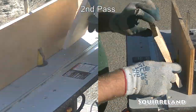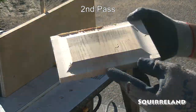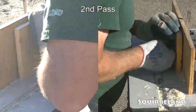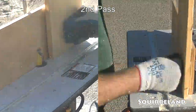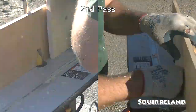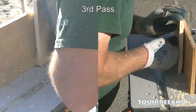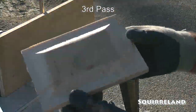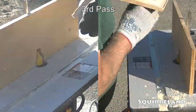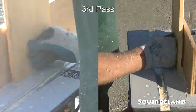This means that after I ran all four sides of all six boards through the router table, I would move the backboard back about an eighth of an inch and do it all again. I also ended up making a modification for the backstop of my router table — I added a piece of plywood with a hole in it that is very close to the size of the router bit. I did this because some of the pieces I'm making are too small to make it across the large opening in the normal backstop. As the pieces would pass by that large opening, they would wobble and make an irregular cut. This way, the cuts are nice and smooth.